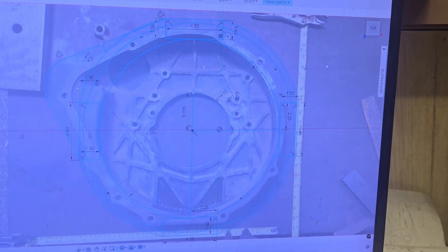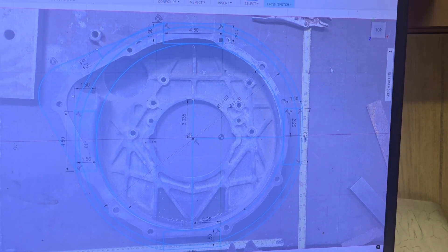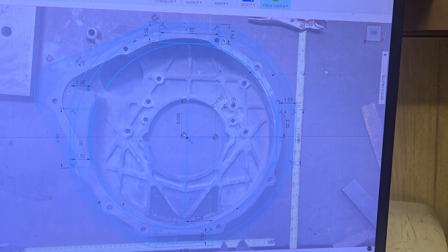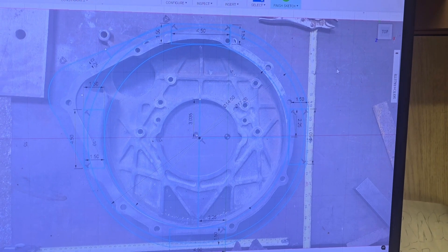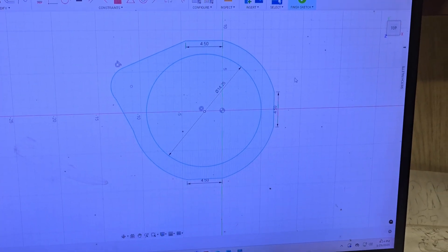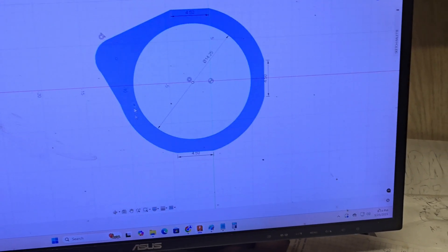Here's the basics of it. I uploaded the photo to Fusion 360 and used it to generally scale the shape. It's not very accurate due to camera angle discrepancies, but I came up with a design — basically two plates sandwiching some inch-and-a-half by inch-and-a-half solid bar. This is a more refined version of the same file. I'm going to convert these over to DXF and upload them to my plasma table to cut them out of half-inch steel. It's going to be two rings with blocks in between to hold them up.